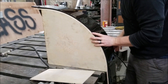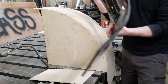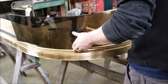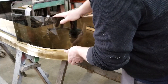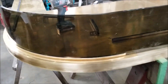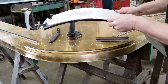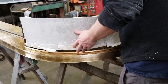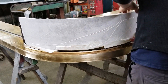I left it about 15 minutes or so, then it was cool enough and it held its shape. I had to find the right section of curve to match the channel, and it fell right in there. Now I just need to trim the ends. I put what's called pre-mask on the acrylic when doing the cutting just to protect the surface from being scratched. I used a regular miter saw to cut the ends and then everything fit perfectly.